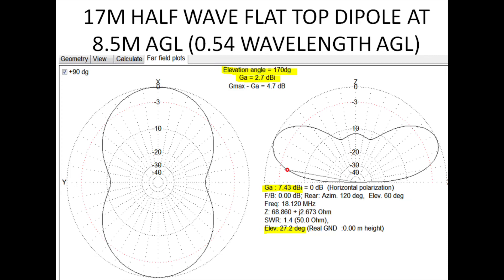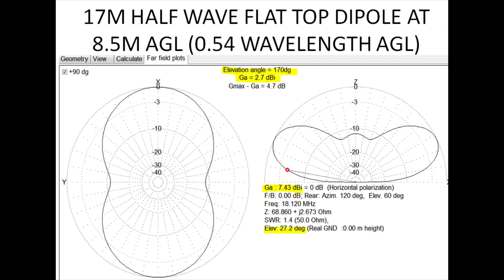If we look at the left-hand azimuth diagram, that's the pattern as if you're flying right over the top of the antenna. The Y-axis goes from 9 o'clock to 3 o'clock — that's how the dipole is oriented. Basically, the majority of the RF is being shot broadside to the dipole, and appreciably less off the ends. So you tend to get nulls on the ends of flat-top dipoles, and your main lobes come off broadside. Unlike a vertical, which is omnidirectional, a dipole has weaker areas around the ends.